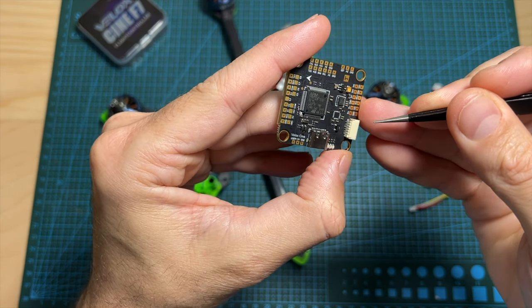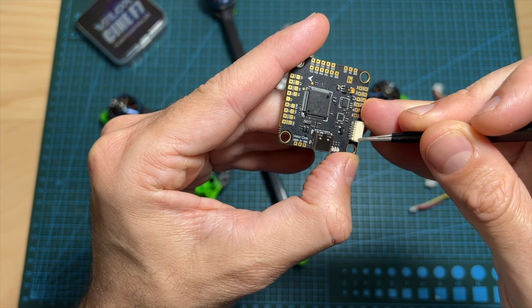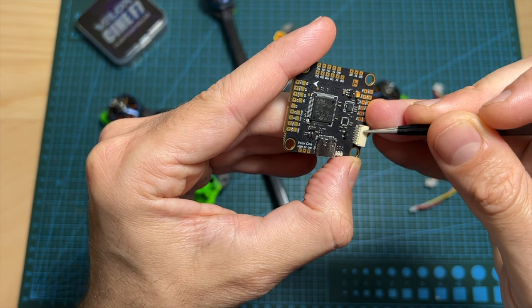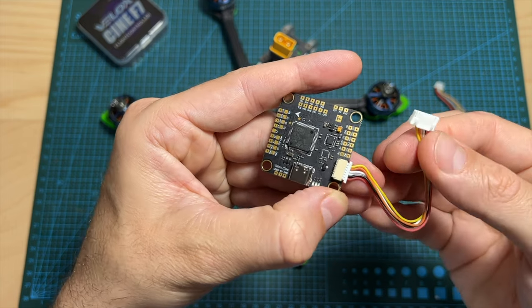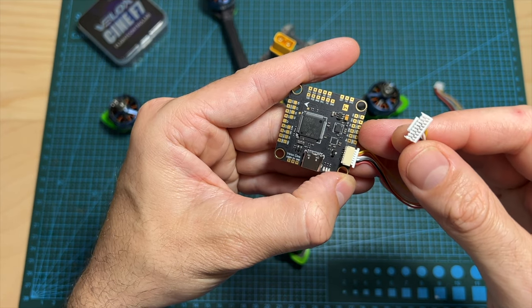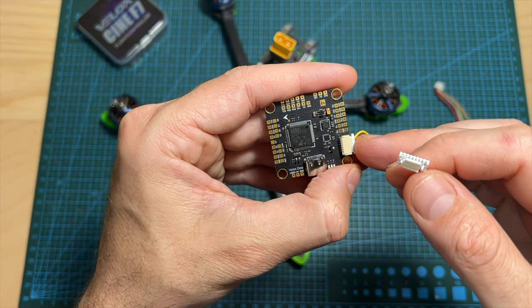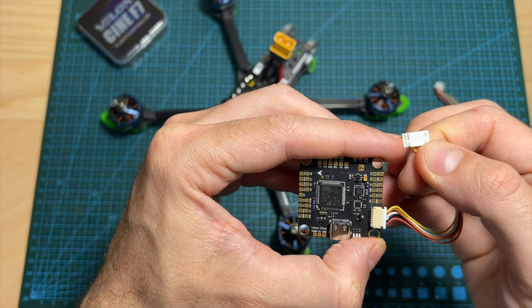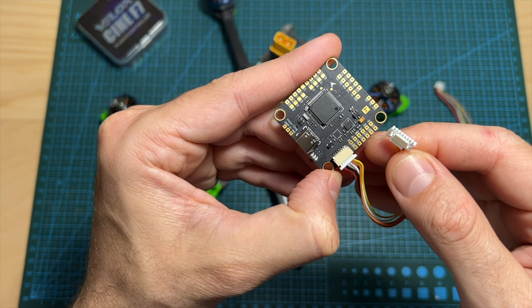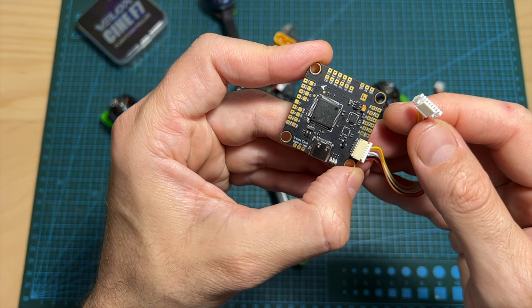According to my test, which was done using a multimeter, the left pin on the 6-pin JST connector is 10 volts, then ground, TX3, RX3, ground, and then RX1. This pinout matches the same layout which is used by the harness for connecting the flight controller to the DJI air unit, so in case you are using the DJI air unit, you can simply use it and plug the other end to the DJI air unit. You'll need to configure MSP OSD switch on UART 3, and in case you are using the DJI radio controller, you can set the radio port to UART number 1.